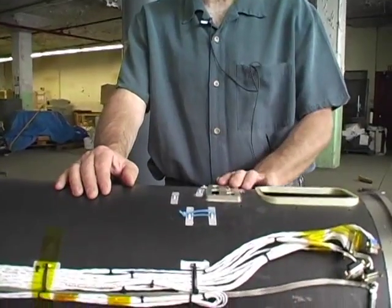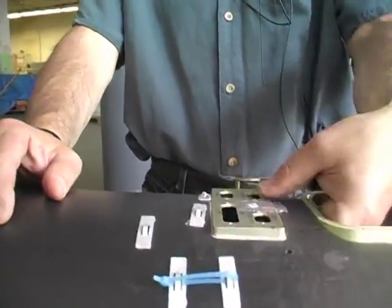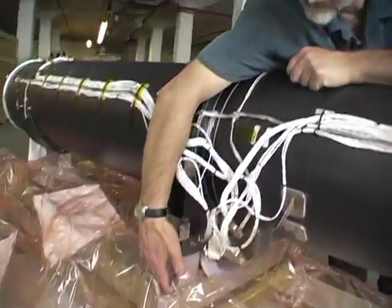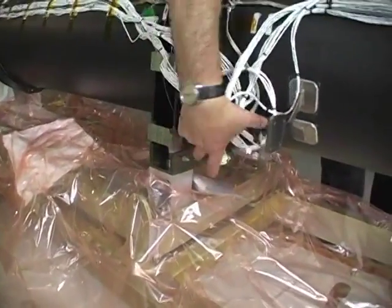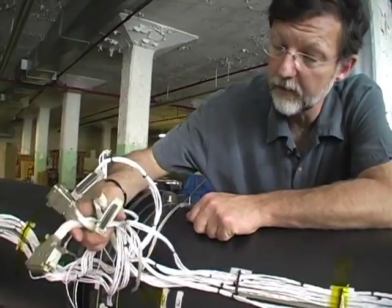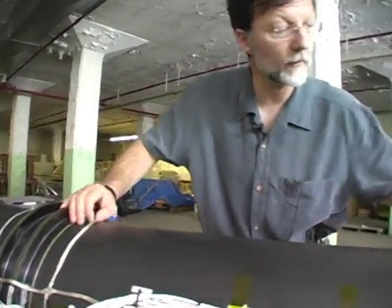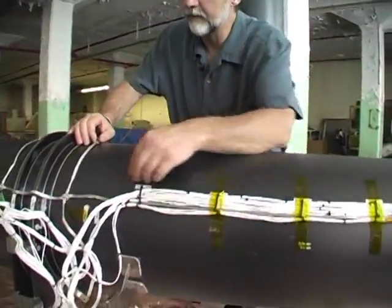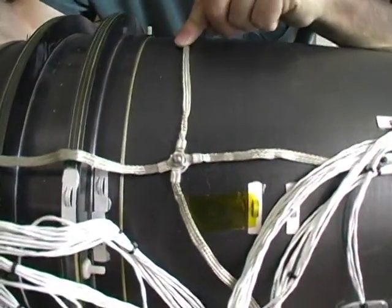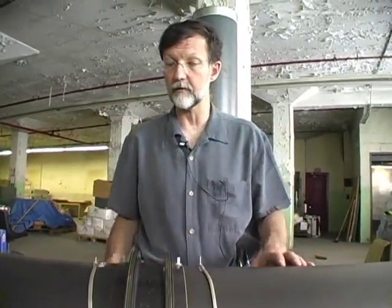There's also this feed through here, and all the wiring on the inside came to feed through connections. The cables came up on the spacecraft from here to the bottom of the box, and then they came out of the box to the various places they had to go. Running underneath and around those covered cables are these open braids, which take care of the grounding, so you don't get very high charges and sparking that kills your electronics.